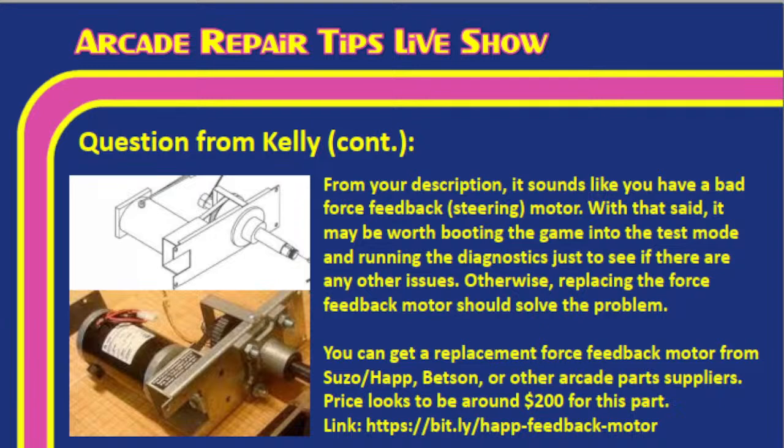I have had it be a board issue. And so there is a force feedback board. That is correct. So that may be worth checking into before you spend that kind of money. But most of the time, those motors would just wear out. There's a brush in there. I think you can unscrew it and put a new brush in there if you're careful. But most of the time, we were replacing a lot of motors, probably few boards.